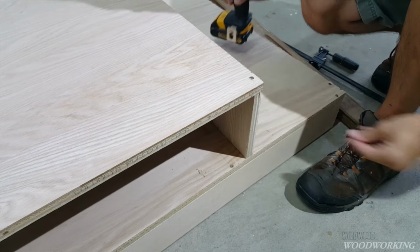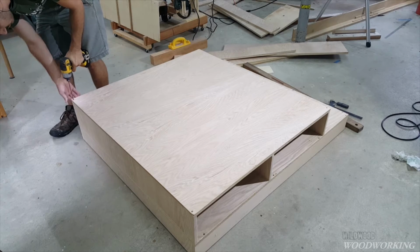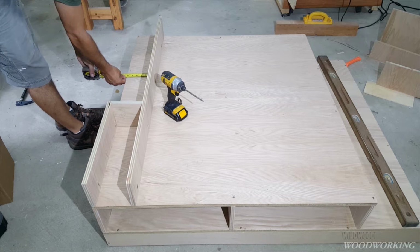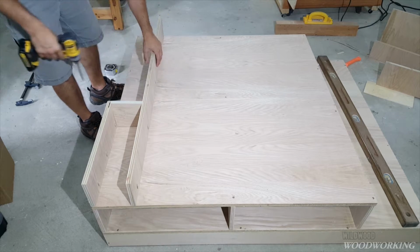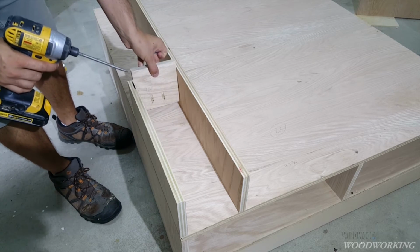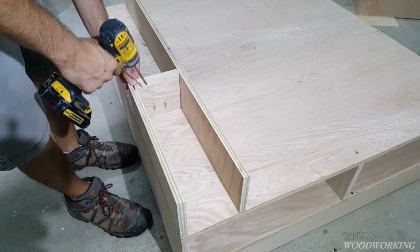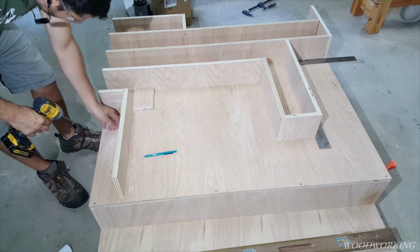So this next layer is the beginning of the vacuum layer. Here I'm going to start laying out all the paths where I want the airflow to go and what tool I want them to go to. Again, I use the pocket hole jig and then a glue as well. In some cases, if it wasn't structural, I just used the pocket hole jig. That seemed to work fine.